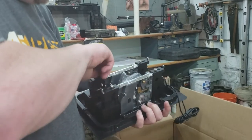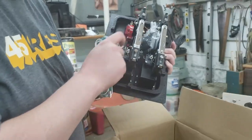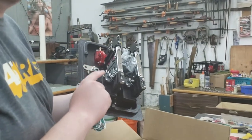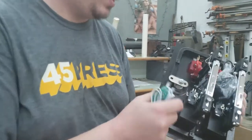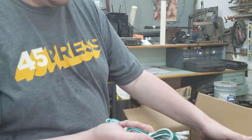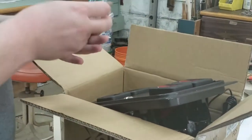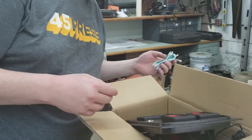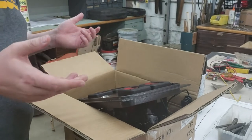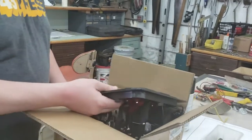The coin mech was coming off a little bit. So that's about it. They do give you the wiring. I'll show you how to wire this up. It goes on the normally open and the comm. I think one is normally open and the other one is the ground. So I'll show you how that works. We're gonna have to cut the ends off of these wires and wire them into a Molex. So we'll have to do a little bit of pinning and stuff like that, but it's not a huge deal. I don't think we're gonna get to that today, but I do have an encoder. If you guys wanna see how to hook it up, how to wire it up, we could do that. So we'll see how things go.